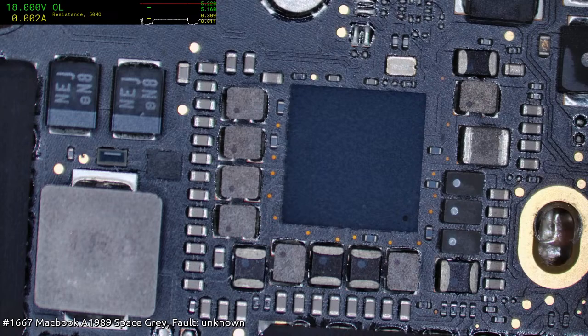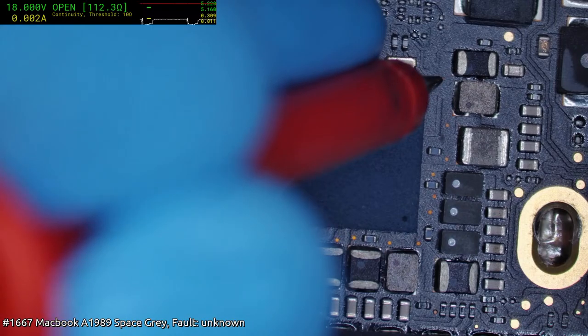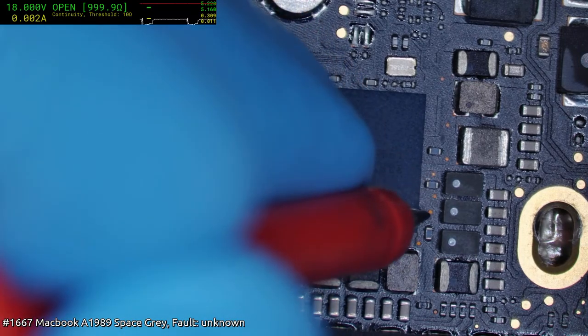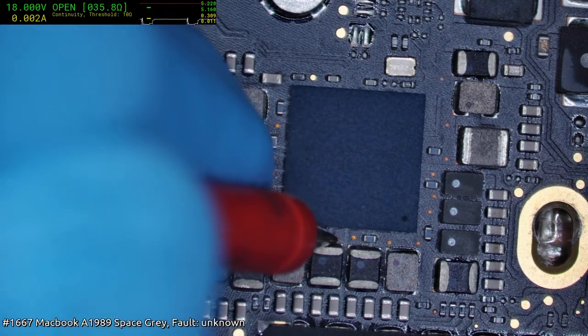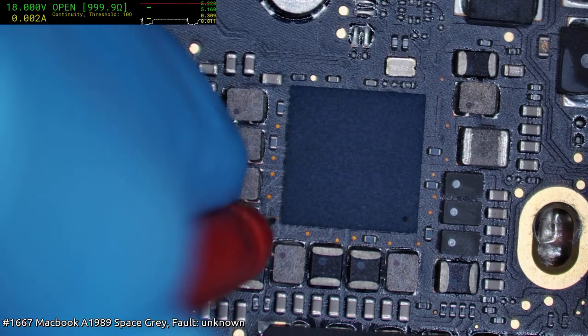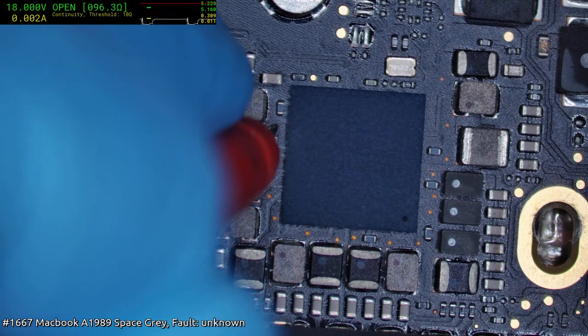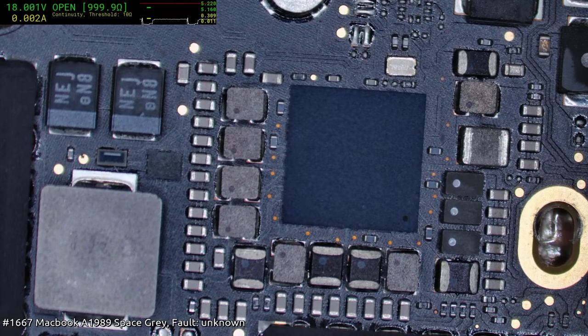And now we'll go and we'll check continuity on all the PMIC outputs. See if anything beeps. Usually though, if it's a PMIC output rail issue, it tends to oscillate. Like you go 200 or 400, 0, 200, 400, 0. But this isn't. This is just locking in at 200 and staying there. Yeah, it's a ground point. At least I think it is. Yeah, that's ground.